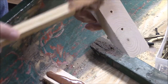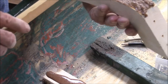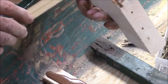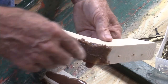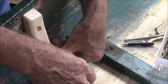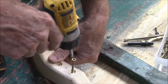Got to work fast because the pot life on this epoxy — if you keep it in a container like this, it hardens much quicker than if you lay it out. And when I say quicker, I mean a lot quicker. What this filler does is fill up any gaps, and when it dries it's stronger than wood. They actually make stitch-and-glue boats with it — take pieces of plywood and stick them together using this stuff.